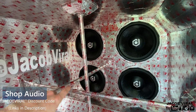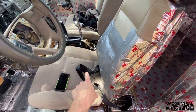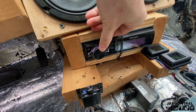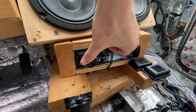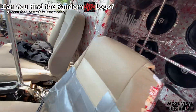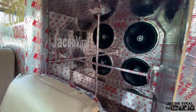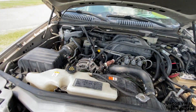Hopefully this will give you a ballpark figure to see how much I'm clamping on these 18s. I'll be doing a test at the high frequency peak — what that means is I'm going to see what this amp is doing at my peak. I peak at 49 hertz with me out of the seat. I need to make sure I'm playing it on music too, at volume 49 or 50. I clip at 50. I'm not going to be doing a burp — it's going to be an actual music run, so I can see real world testing results.